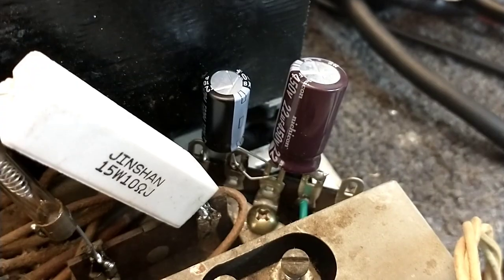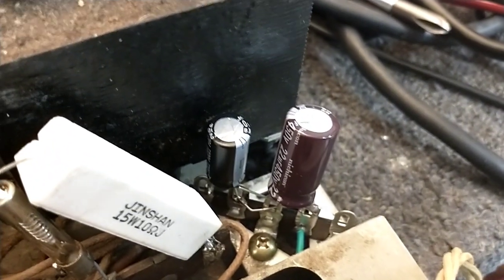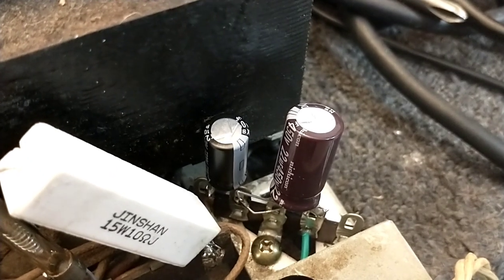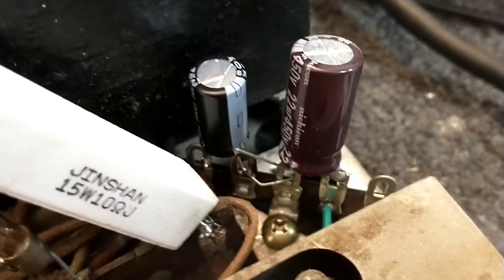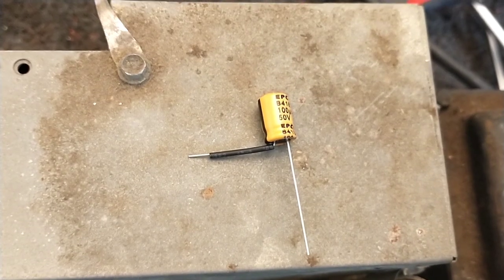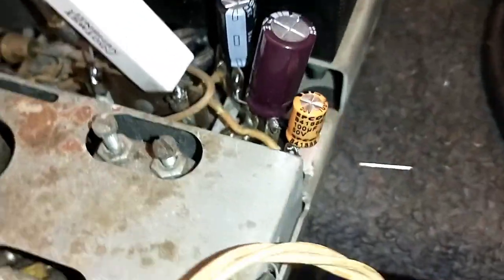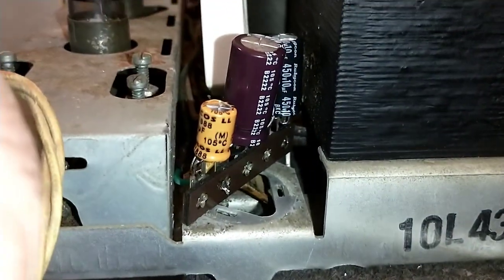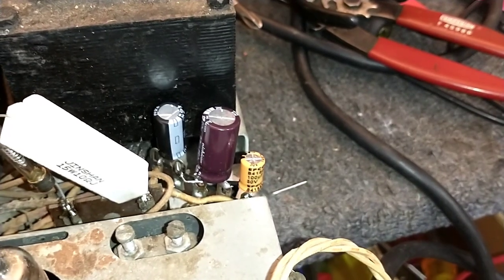Hiding the terminal strip back here is going to be our best bet — we've got enough room for everything. There's our 10 and there's our 22 in there. I had to extend the lead a little bit with some shrink tubing because the old one wasn't quite long enough. The only one left is the 100-microfarad, which is going to go right there. We'll heat-shrink the negative lead and pass it through with the others, then solder it all together. You can see the negative lead heat-shrunk so it'll pass by the others without risk of shorting out. So we got everything in here, all wired up. That's one of the three cans done.